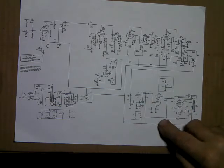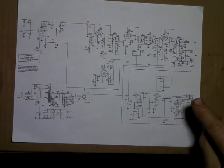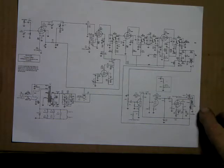So I went through several different iterations, and finally I found a 6V6 guitar amp that had the correct input, used a 12AX7 as a preamp, first and second stage, and a driver, and the 6V6. The next task I had to find was the audio output transformer, since the original transformer in the Johnson would not match up with the 6V6. It ended up that I found a 70 volt line matching transformer.